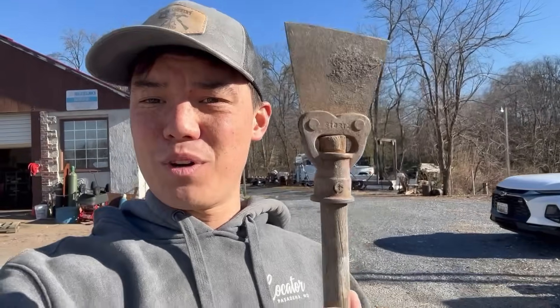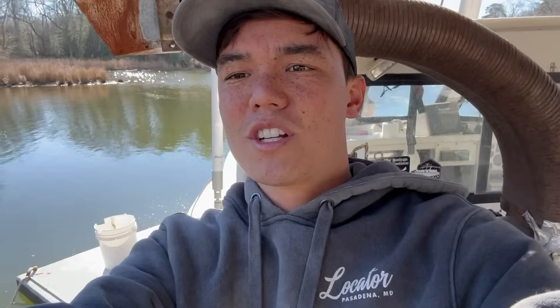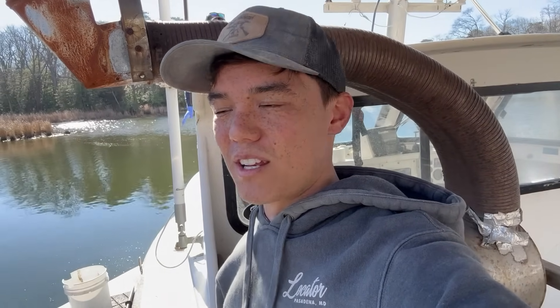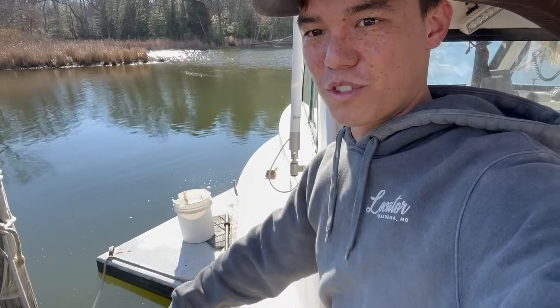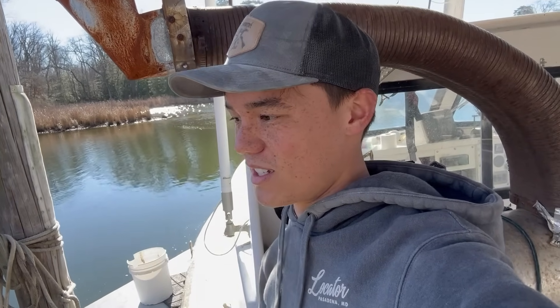This scraper is my favorite — it's certainly from the early to mid-1900s, but it works pretty good. We've pretty much got all the paint scraped off that we could get scraped off on the cabin, and this is the last time you'll see me not completely covered in dust. So we're going to start grinding — I'll start on the work float, grind all the way around, go down to 60 grit and then back up to 120. Probably got a couple days of grinding and sanding just on the cabin.